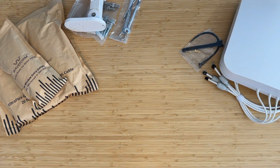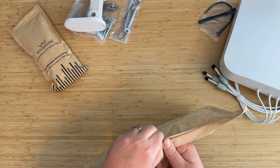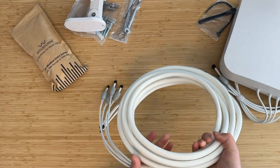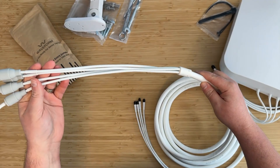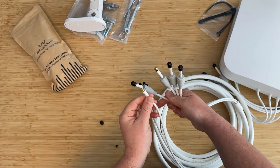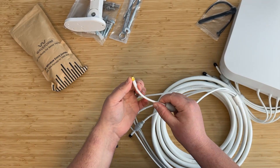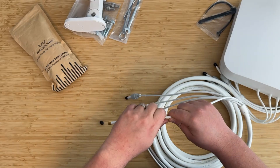Let's take a deeper look at the UltraFlex quad cable. This is basically four cables in one — an evolution of our previous quad cables. The goal was to make a cable that's incredibly thin and flexible and nice to handle. It has a really thin outer jacket, terminated in grommets to keep it weatherproof, with 15 inches of separated ends terminated in SMA female to SMA male. The cable is completely modular and extendable. On the male end we also have weatherproofing boots. And the benefit of such a flexible cable is that if you have one of the new T-Mobile G4 devices, it can bend and go right into that connector without any need for a right-angle adapter.